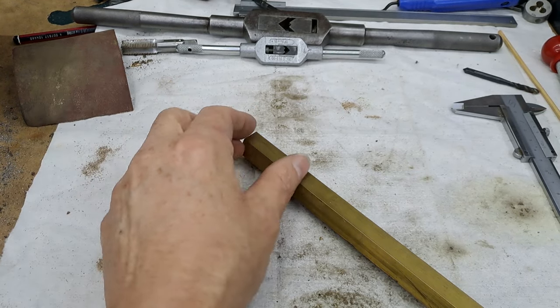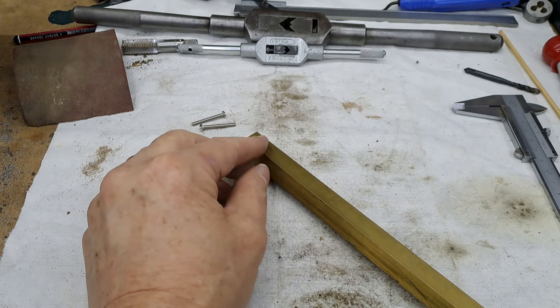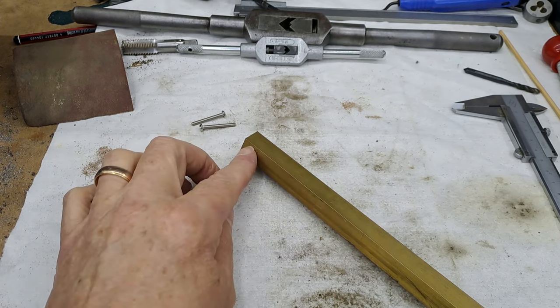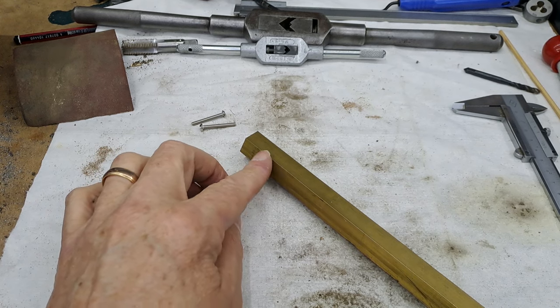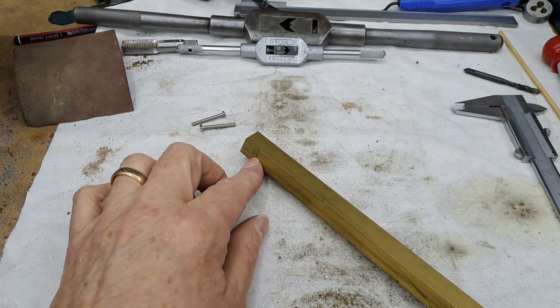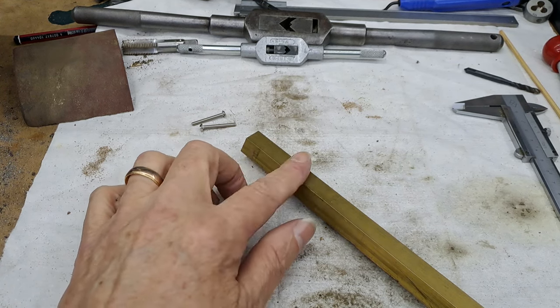And these are the parts that the head of the non-return valves flop around in, and the little stainless screws there just stop the valve shooting too far and jamming out. It just allows it to lift enough to let the water pass through the axle pump. Right, guys. Let me get this in the lathe, get my little drawing ready, and I'll be right back to you.